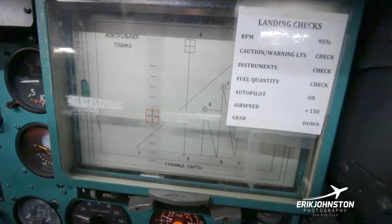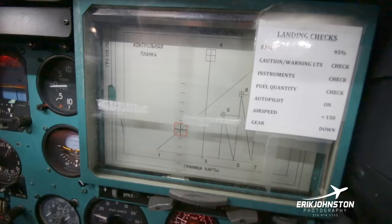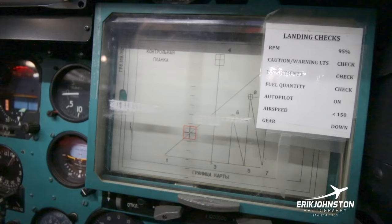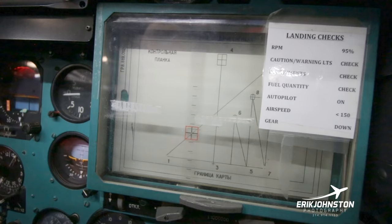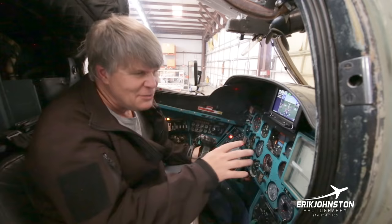You would adjust it to, let's say, where you are. Let's say I'm right on the intersection right there. And then you would start the Doppler system, and this cross would start actually moving around with where you are. It's just taking the Doppler inputs. It's adding the north-south, relative to the aircraft, and east-west or left-right relative to the aircraft. It's putting it in here, and then positionally, it's making adjustments for where the aircraft is also with the map of the Earth. So this is just using old Doppler technology to actually move the crosshairs on this.